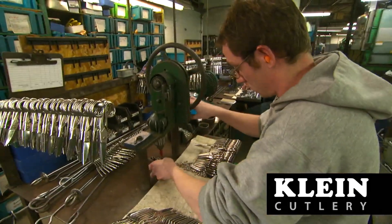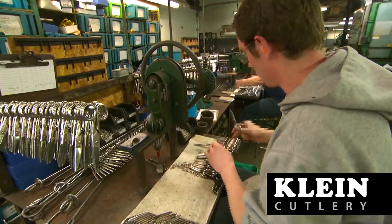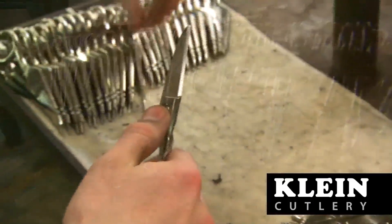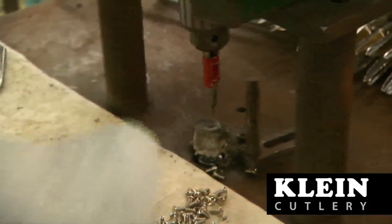After dipping the handles and curing them in a baking oven, the coated top and bottom blades are assembled using a proprietary tri-lobular screw which is tightened to a predetermined torque value. These self-locking screws keep the two blades tightly together for consistently smooth cuts.